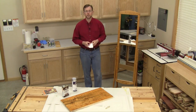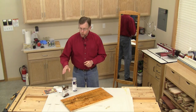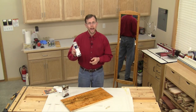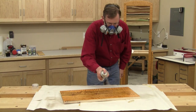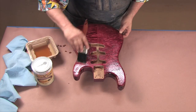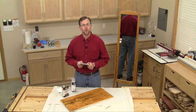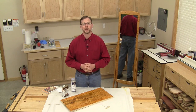Give the Danish oil overnight to dry and then you're set for the third and final step: adding a protective top coat. You could stick with Danish oil and apply more coats, switch to an oil-based varnish, use shellac, or go with lacquer as I did. I applied six coats of a satin sheen spray-on lacquer — it builds to a nice flat film, dries super fast, and leaves a soapy smooth feel on the wood that I really like. If you want lots of great information on general finishing, check out Michael Dresner's DVD, The Way to Woodwork: Step-by-Step to a Perfect Finish, available at woodworkersjournal.com or rockler.com. Good luck with your mirror project and all your finishing efforts — thanks for watching.